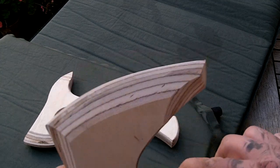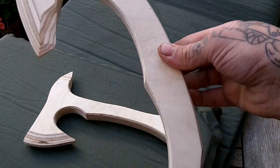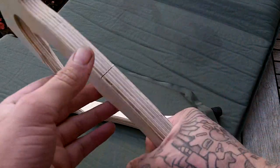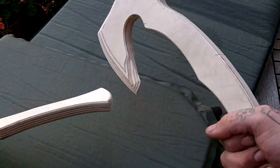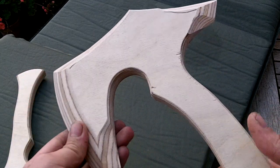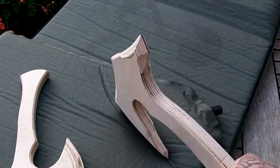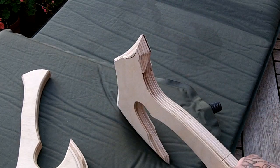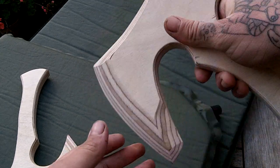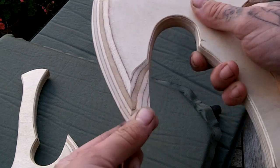This one is going to be my breaching tool — we've had a bit of a mess around to get an idea of what it's like. I've altered the grip slightly, narrowed this section here and narrowed this section here. You've got a very solid hold with the curve, which will give maximum power with force being multiplied into this area. You've got a secondary hold where that little part fills the palm — still gives you more control but with plenty of power. Choked up, it will have a sharpened bottom edge of the beard and a sharpened tanto-ish section there.